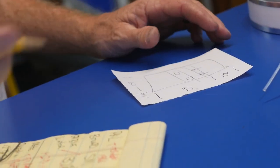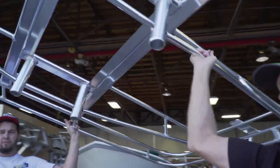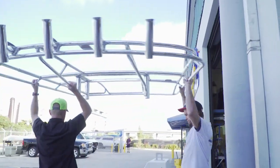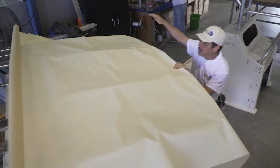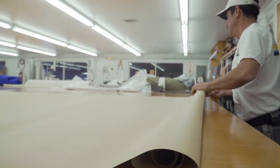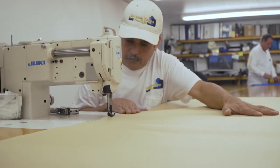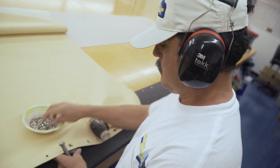After listening to Al and taking into consideration all of his needs, we went back to the drawing board and came up with some great ideas. What we do is fabricate a blueprint of the top section, then somebody fabricates the sunshade. All the dimensions are taken, the top section is mostly welded out, and the canvas guy comes down to fit the canvas. The weblon Al picked is a duplex color — ivory with sand on top — which is nice because it's a vinyl-style material that can be wiped off and doesn't leak water.